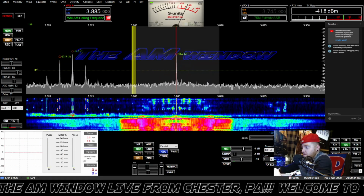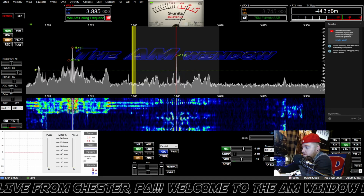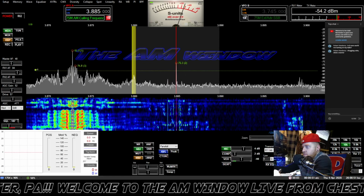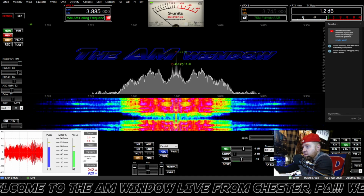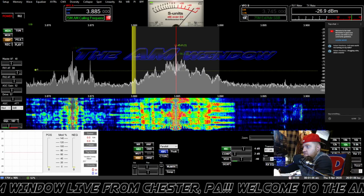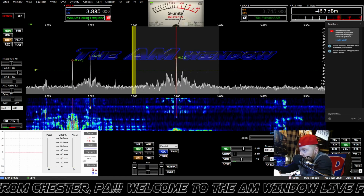Sibilance. All right, we'll talk a little bit, and I'm just curious how wide this modified DX60 that we're using is. Good old screen modulated, none of them heavy transformers. Yeah, you're plus or minus 5 kc, 10k total. I don't see much energy out after that. You've got some pretty significant stuff on the S's and T's. It's going out about 5.5, maybe closer to 6. Over here, I might have more signal on you. Maybe. Yeah, that's possible.